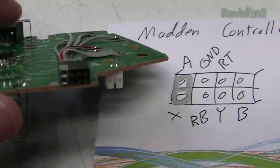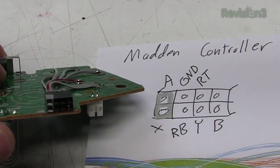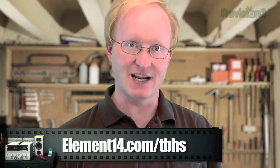Now we've attached the header and all the wires to the buttons. As you can see, the wires have been soldered in the order in which they came off the header, which makes it look nicer and also makes it flatter and more compact. We've written down the pinout so we'll remember it later after we've closed up the controller. Now we're going to take a quick break from the viewer challenge and start on the big build — modifying an Xbox 360 into a laptop, which will be given away to one lucky viewer. Visit my page on element14.com for more details.